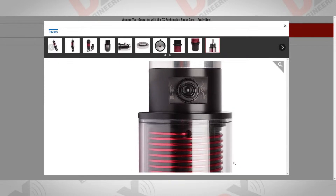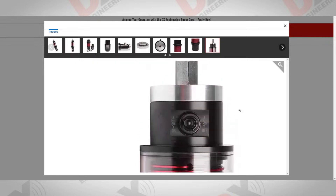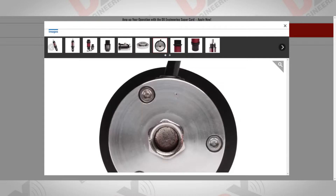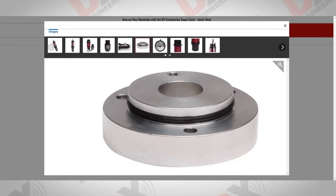That's the switch I was mentioning — it's a waterproof toggle switch that'll turn that coil either on or off. The whole body of the antenna is also weather sealed. We have O-rings and gaskets at all the joints to make sure that water stays out of the coil. You can use it in the rain and leave it up if you want. Makes for a very robust design.